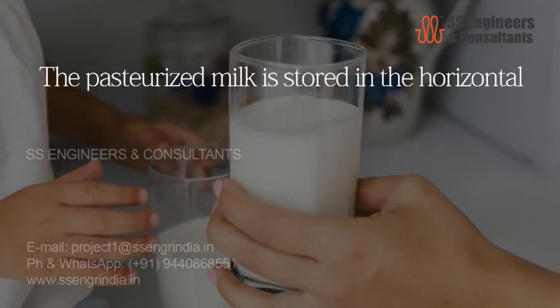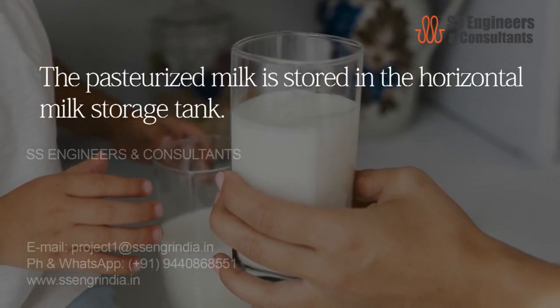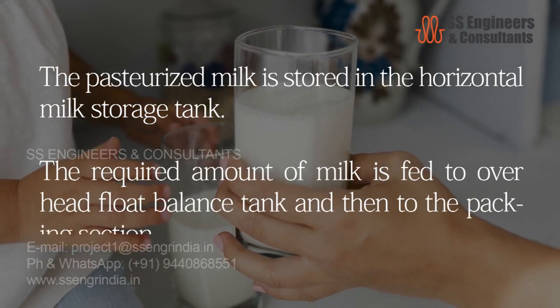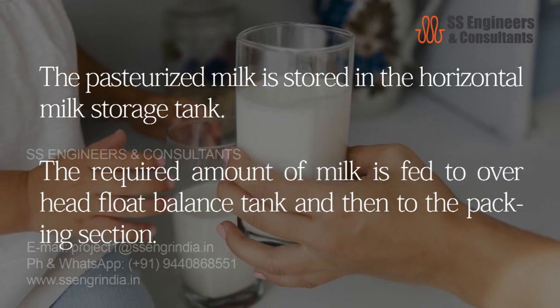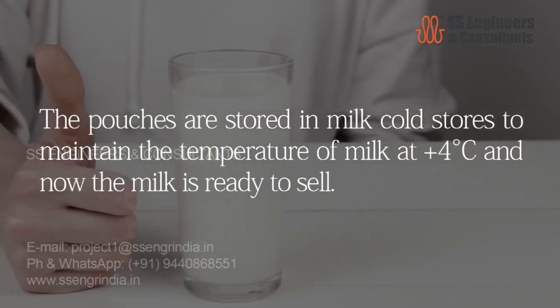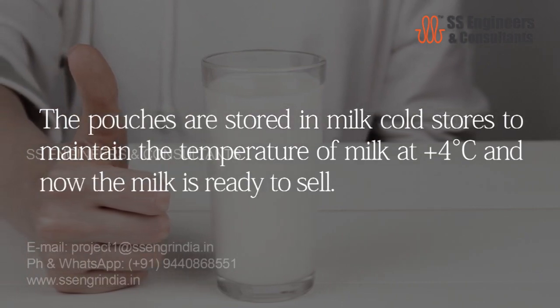The pasteurized milk is stored in the horizontal milk storage tank. The required amount of milk is fed to overhead float balance tank and then to the packing section. The pouches are stored in milk cold stores to maintain the temperature of milk at +4 degrees Celsius, and now the milk is ready to sell.